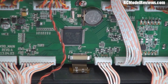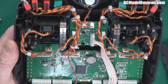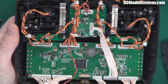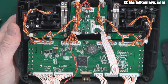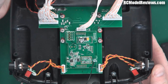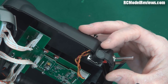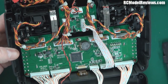One really can't complain about the build quality of this radio — it is really rather good. I am impressed. It is certainly not a cheap budget radio from a build quality perspective, and that looks to be what FrSky are delivering. The quality of this build is truly world class — as good as any of the big brand names I've seen, and a lot better than some of their cheaper radios. When you buy a really cheap Futaba or JR radio like a four or six channel, quite often they're made to a price and the quality isn't much better than the Turnigy. I can obviously solve the little detent issue because there's a little metal piece on the side where I can just increase the tension to get a much firmer detent in the mid position — nothing big to change.